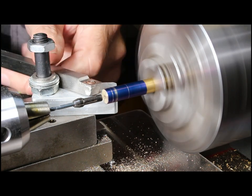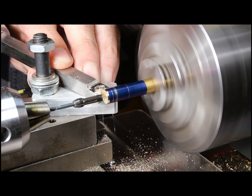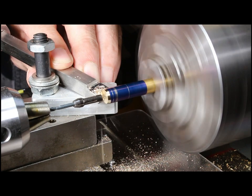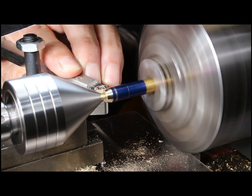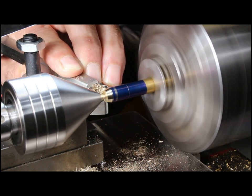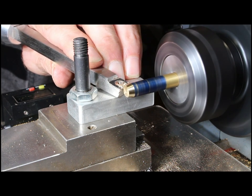I'm going to try using a woodworking carbide insert scraping tool that I would use on my woodworking lathe. Notice it's kind of wiggling there because my chuck is about 8 thou off-center and I'm not liking the feel of this, but I'm going to persevere. I brought in the live center thinking I could firm things up, but I'm still ignoring the fact that the chuck is so off-center it's wobbling. So I switched to my collet chuck, which has much better concentricity.